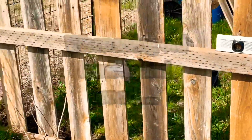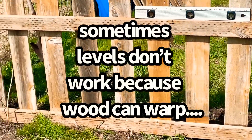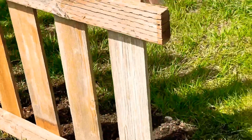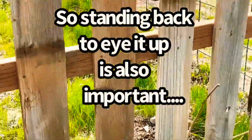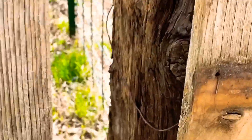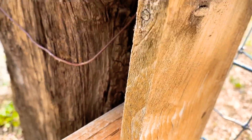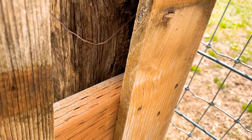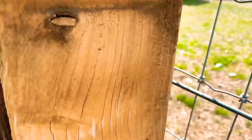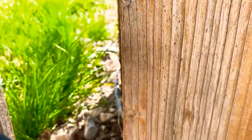Here's what the inside of the fence will look like. Now that the panel is up, I'm going to find the hardware I need — probably just a big long screw — and attach this existing fence post to the new panel board. I'm going to do it through these two access points through the thickest part of the fence, there and down here.